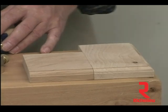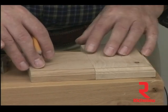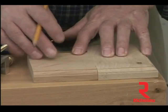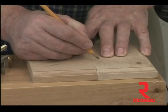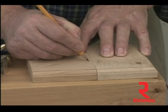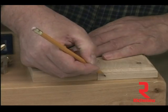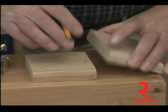The first step is to take the two wooden workpieces, place them together like so. Now it should be understood that the important faces when we finish with the joint are these two faces and these two edges. Now what we do is we mark these reference faces with check marks on the important faces like so, and we place an X on the surfaces to be drilled.